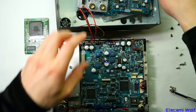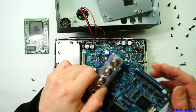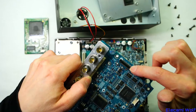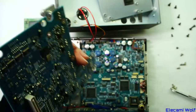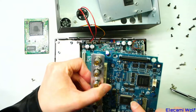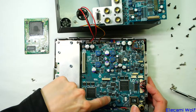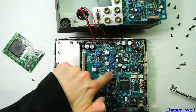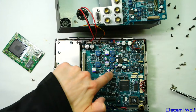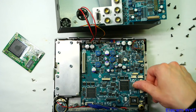So the signal path is: connectors on the top board → through the Altera Cyclone → to a header → down to this board through buffers → into the first Cyclone II → out through another header onto this board → through more buffers into the second Cyclone II → through an LVDS driver → then to the wires going to the panel. The signal passes through at least two or three CPLDs on its way from connectors to panel.